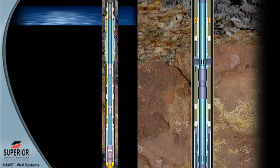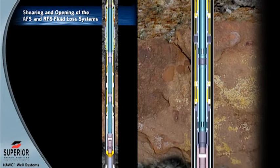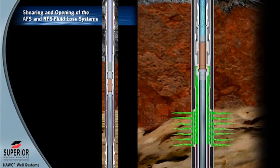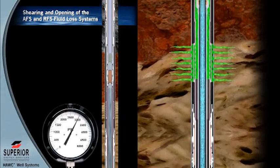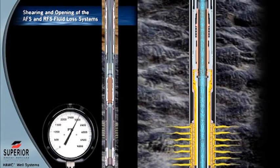The annular and radial flow valves are opened by applying pressure to the ID of the concentric isolation production string. This is accomplished by closing the upper hydraulic multi-service valve and opening the lower hydraulic multi-service valve. This allows pressure to communicate through the Hawk system down the production tubing to the ID of the annular flow valve and the radial flow valve. Internal tubing pressure will actuate the annular flow valve, opening the annular flow path, while maintaining tubing pressure integrity. Internal tubing pressure will also initiate actuation of the radial flow valve. The actuation pressure unlocks the valve but does not yet open the flow path from the lower zone to the isolation tubing.